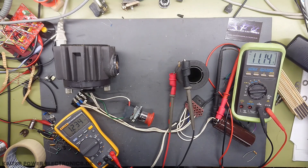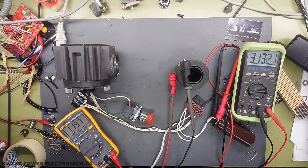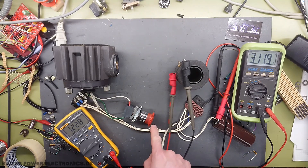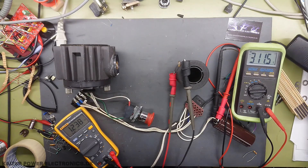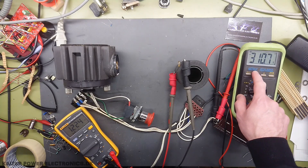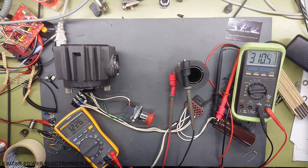At first, let me charge the capacitor to 310 volts. Once it's charged up, I will turn it back down again to 70 volt DC on the variac. The capacitor remains charged at this point, and by closing the switch we should get an arc and the output. It's interesting to see how fast the voltage is actually going to drop. Here goes.